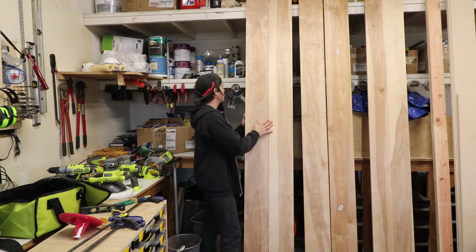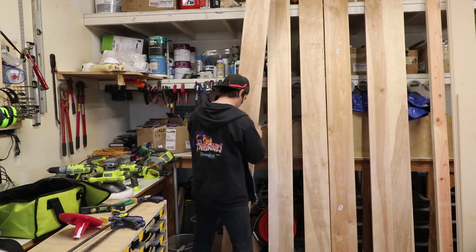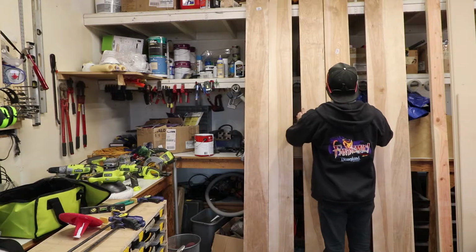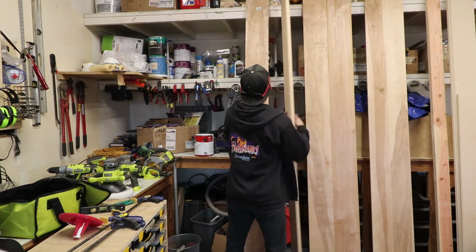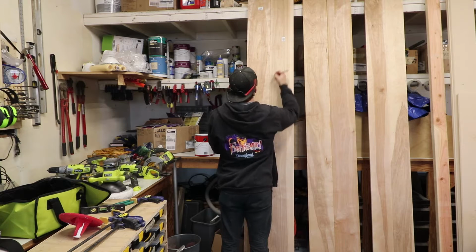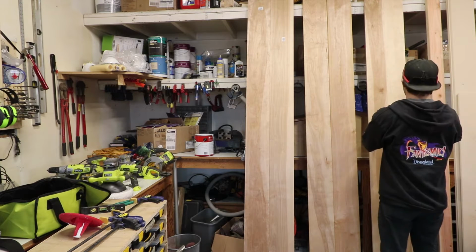I got a few different widths based on the design of the mantle. The widest board I could get was 7.5 inches, and I needed a board about 13 inches wide, so that meant I'd be pairing two boards together. I had to do this for the bottom and the top of the mantle, as well as the front face and sides. The front face of it would only be 8.5 inches tall, so I paired two 5.5 inch boards together for that.